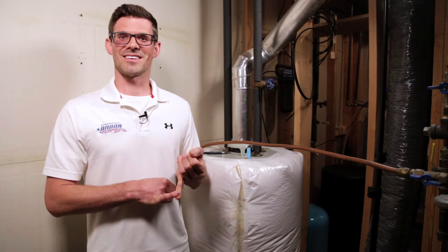Some of the things that could cause backdrafting are a blocked intake on a combustion air, improper sealing, or an orphaned water heater. Checking for backdraft is often something that's overlooked, but we feel it's important in ensuring the health and safety of you and your family. I'm Jesse with American Radon Mitigation. Thanks for watching.